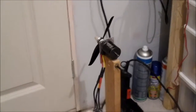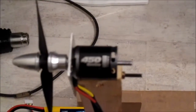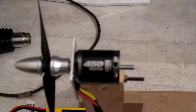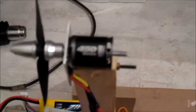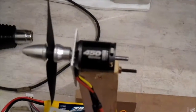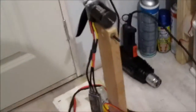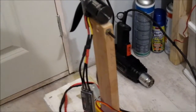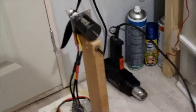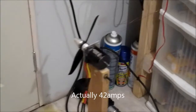Hello, I'm about to do one of my motor tests. This was a curious one, just going to be a quick test. I decided to buy one of these NTM heli motors - well, rotor drive motors, 450 series. It's 1700kV, basically a 2836 size, but it's rated up to 6S. I think it's 930 watts, rated to 40 amps. I thought I'd see what it was like with a prop.